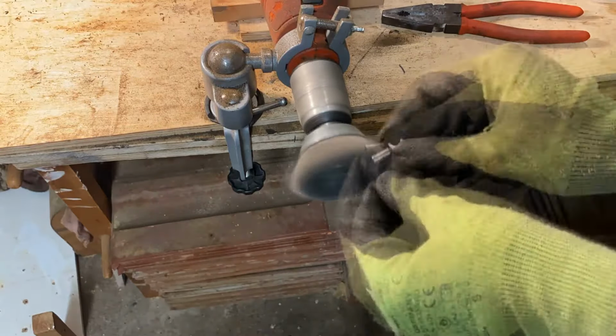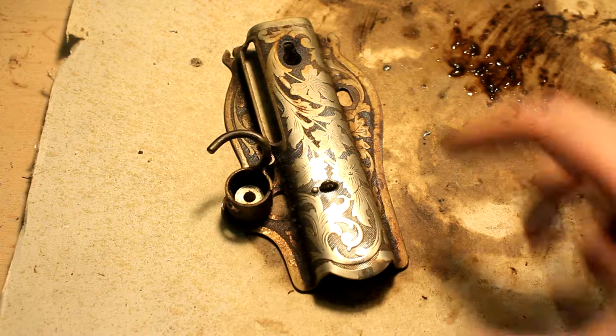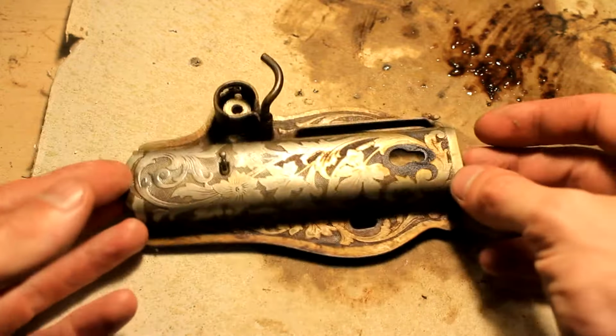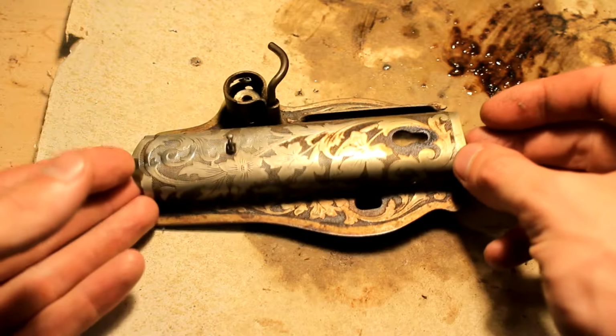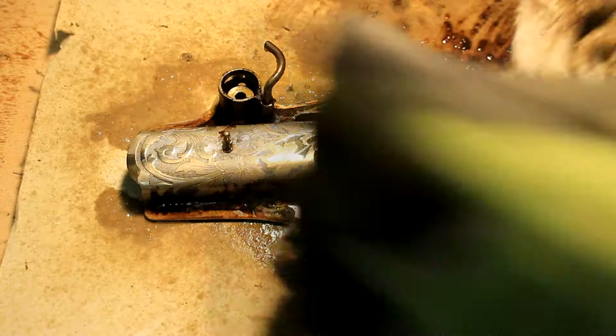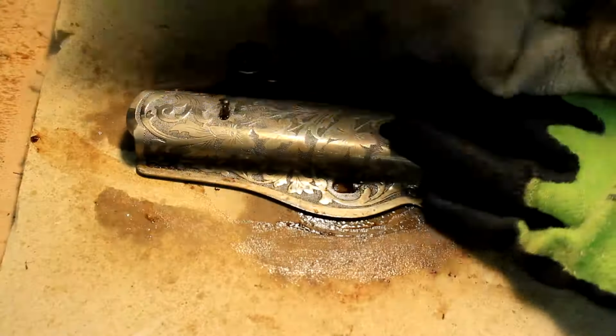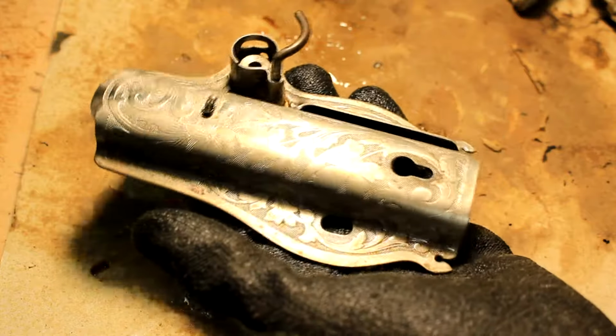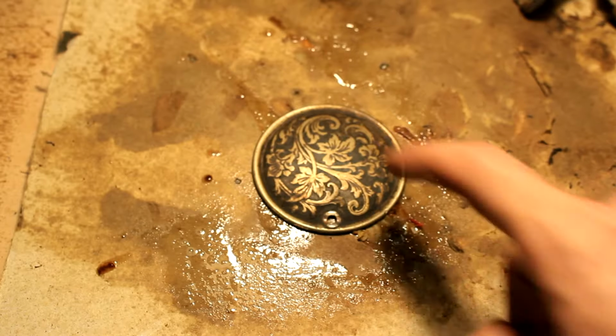And now I had to turn to the most beautiful parts of the machine. And unfortunately, these are coated with nickel, and that means that cold grease remover kind of damages the finish. And I didn't know this when I was doing the restoration. So I have a couple of spots where the nickel started to peel off. And unfortunately, there's nothing I can do about that. And next time, I guess I have to be more careful with the solvents I use.